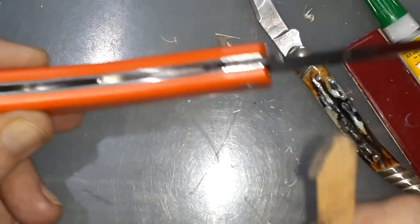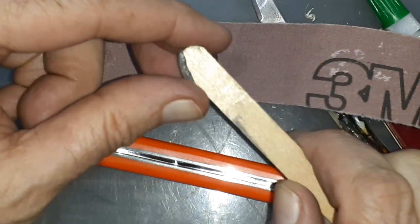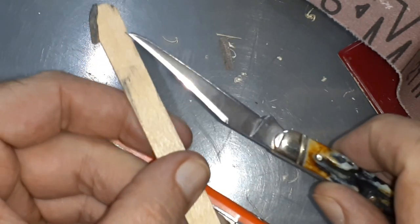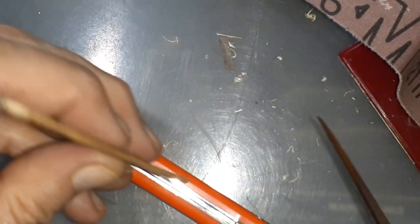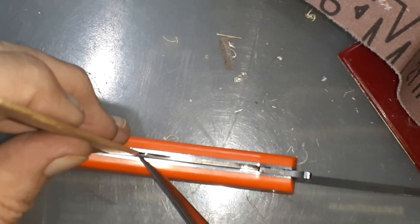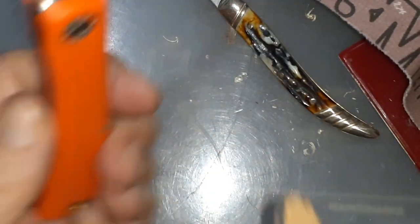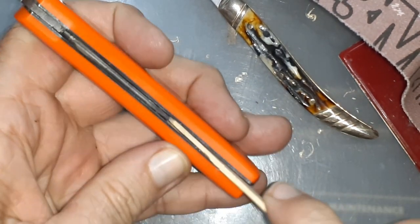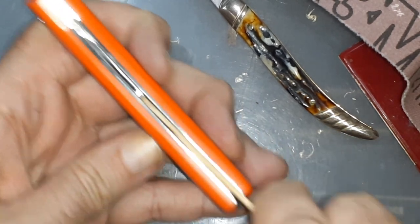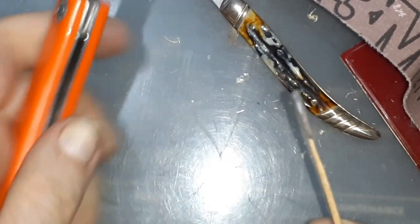You can see all that shiny and polished area because I basically took some emery cloth — this one happened to be 320 grit — and a popsicle stick. I took a toothpick and whittled it down because it wouldn't fit. If you put any emery cloth on it, you're not going to have enough distance to fit a popsicle stick in there. I wanted something that would fit in because it kind of goes in hard. I just want to polish that raised area on the pin, going back and forth. Because this is 320 grit and it's just a small area.